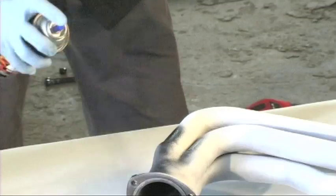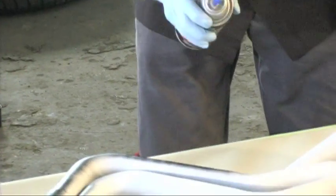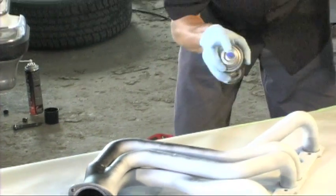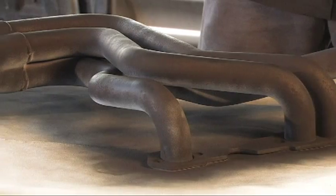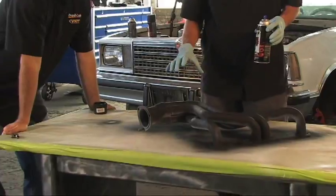As you can see, this paint comes out as a flat finish when it dries — it isn't a glossy finish. Now we do offer a satin clear, but the reason why this product isn't glossy is because of the high temperature pigments in the paint. Any type of gloss just won't be as heat resistant, so all the flame proof paints we have come out as a flat finish.